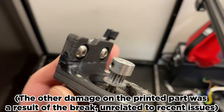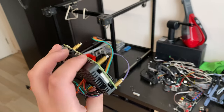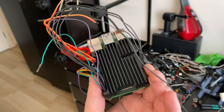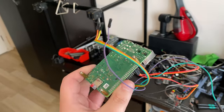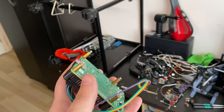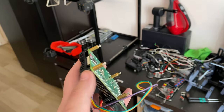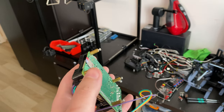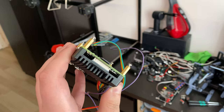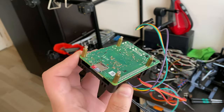I removed my Raspberry Pi. A tip that might be useful: if you have one of these heat sinks and find it difficult to mount with the other heat sink part in the back, the solution is simple — grab M2.5 standoffs, screw them into the heat sink, then use screws to mount it through the other side. So far that's the only easy way I found to mount this type of heat sink, but it works really well.